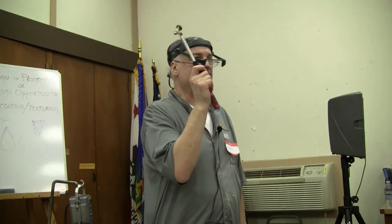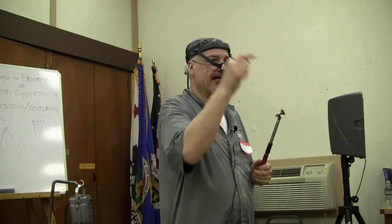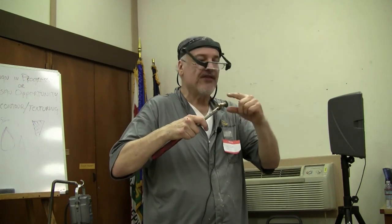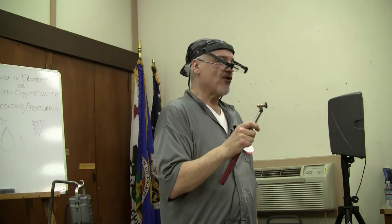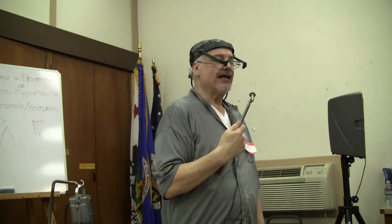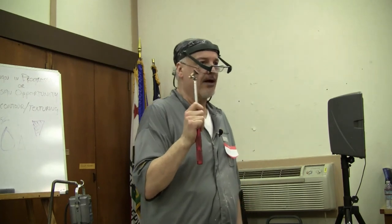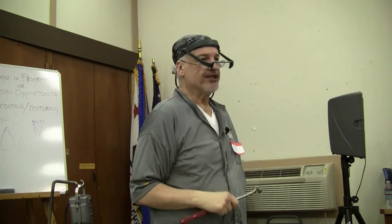What's great about this, in case you never have it, is that how many of you take a sandpaper and as you're sanding, it leaves very fine lines in it? Mm-hmm. This head spins and rotates as your piece is turning. This is spinning, so therefore, it's taking out all those scratches. So you don't have to go from 80 to 4,000, you can get that down to 400 if you want to, or then you can get to the point where you're just using either a burgundy or a green 3M pad and just use that to help polish the wood.